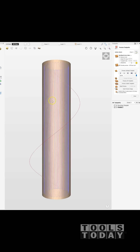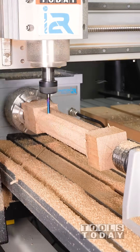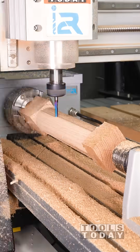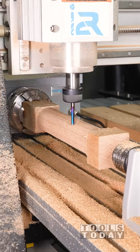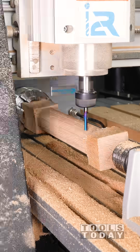You can see how it wraps that flat design along the A-axis. Now that we're going with the grain, it is leaving a cleaner cut; however, we're getting a bunch of step lines. There are some other issues going on that I don't quite understand yet, but this is literally my first time using the rotary — I'm learning and you're watching me learn.